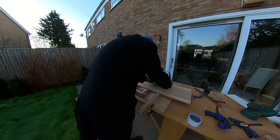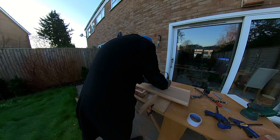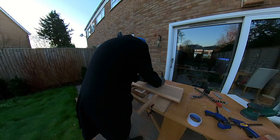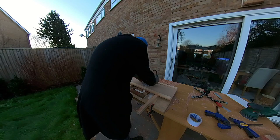When you're ready to start cutting, turn the router on and, assuming it spins clockwise, move it over so that the cutting head is to the right of the workpiece and it's pushed back to your starting point, in my case 25cm. Slowly move it over to the left until the cutting head has passed to the left of the work. Your first cut probably won't actually take off any material, so now we move the router slightly further away,